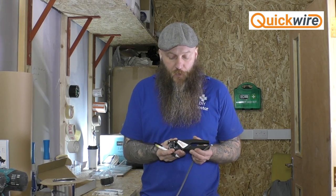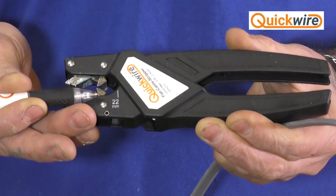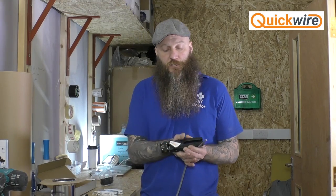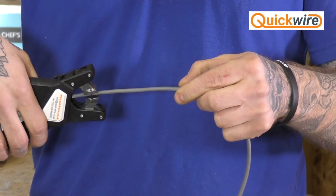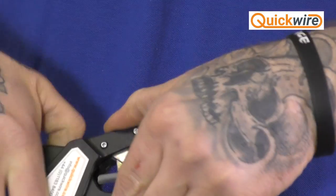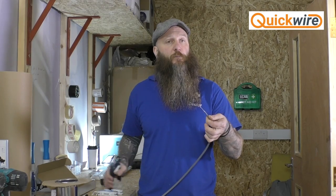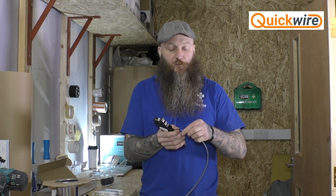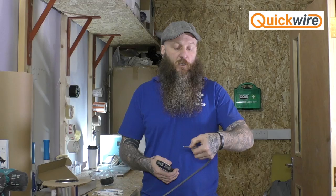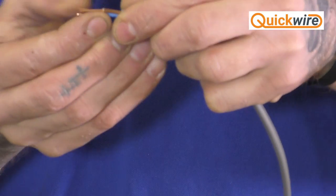The strippers have 22 millimeters helpfully marked on the place where you position the cable, so you know exactly how much you're stripping off. You simply take the end of your cable — we've got a piece of one-mil twin-and-earth — place it in, ensure it is lined up with the 22 millimeter point, squeeze the handles together, and remove. It takes exactly 22 millimeters of sheathing off. For the internal cores it's exactly the same: give yourself a couple of mil, insert the cable, squeeze the handles together and your internal cores are stripped back perfectly.